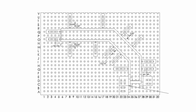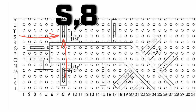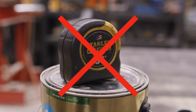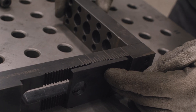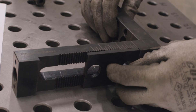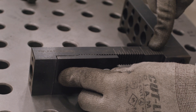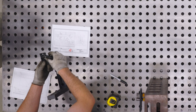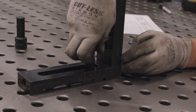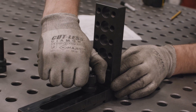Now we need to look at our fixture map. From here I can see I need to place some tooth blocks down on the table. This first hole is my ID hole and it lines up with S8. This system doesn't need a tape measure because not only do we have a hole ID, we have fixture locations. The first hole lines up in the washer with the slot — this is called zero position. Every time we jump a tooth, the body moves forward one eighth of an inch, all the way to two and a half inches extension. So I drop the locking bolt and washer in the corresponding hole at S8, match a quarter inch extension, and drop it in. Just like that, this fixture is in the exact location it needs to be — no tape measure necessary.